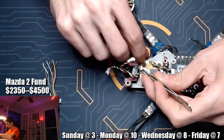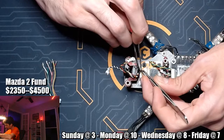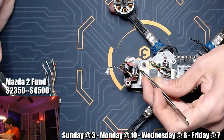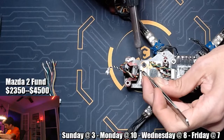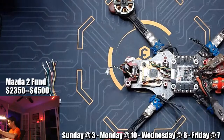So what I like to do when I put these things on the pad sideways is make sure that the wire is all the way down flat against the board. And then we just bring the heat in, just touch it for a split second, and it'll give a beautiful little solder joint. So let's bring this in here. All right, there we go. Just take a tiny little bit of this extra solder off of here. There we go. And I just want to come in one more time.